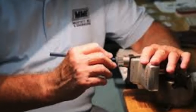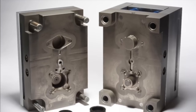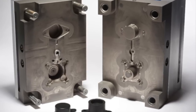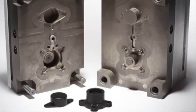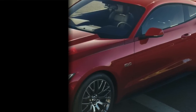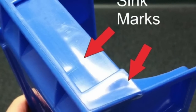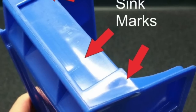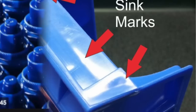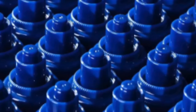The other reason is they are made by hand — you have to carve out the tool. In order to make sure the tool reflects the sculpt of the action figure, it takes a lot of work. A giant tool like this is used just to produce that small plastic cap at the bottom. The tools have to be big because they have to withstand the heat of the plastic. A tool for an action figure is going to cost as much as a luxury car — anywhere from $30,000 to $100,000. There are also many ways tooling can be defective, which is why quality matters to avoid scuff marks or sink marks, where the plastic indents when it comes out of the tool. You also want every object that comes out to be uniform — you don't want one arm or one bottle cap to be longer or different from the others.